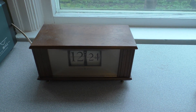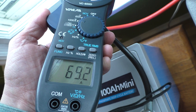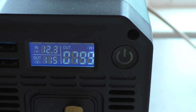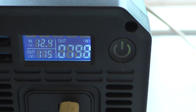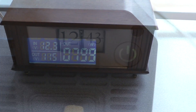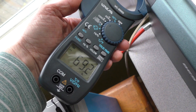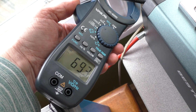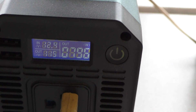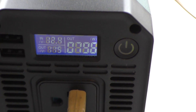At 24 minutes into the test: amps are at 69.2, voltage is at 12.3 to 12.4 volts, and we're drawing 798 watts. At 43 minutes in — about halfway — we're still at about 69.3 amps, voltage still at 12.3 volts, and still drawing 797 watts.